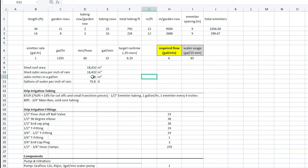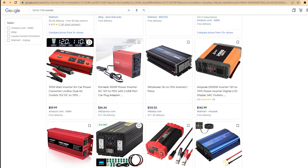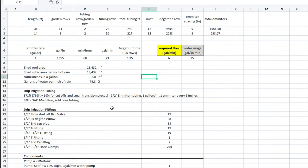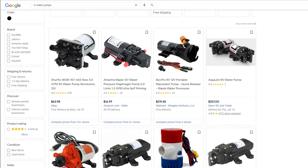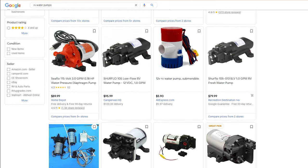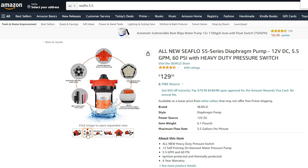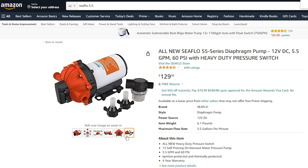Let's move on to selecting a pump. A solar system is typically run off 12 volts, but you can add an inverter to convert to 110 volts and run a bigger pump or broaden your selection. Let's look at using a 12-volt pump that can flow around our 6 gallons per minute requirement. There's a wide variety of options for RV water pumps, which turn on when water pressure drops and shut off when pressure rises. Seaflow is a reputable brand — I chose to use a 5.5-gallon-per-minute 12-volt Seaflow pump, and I'll leave a link in the description.